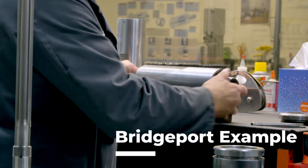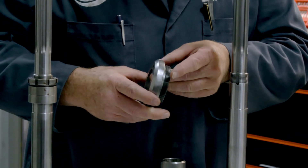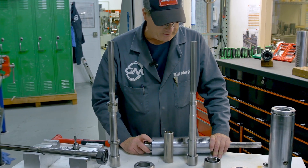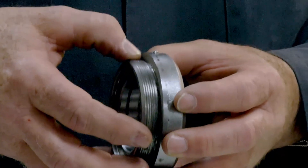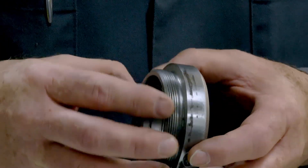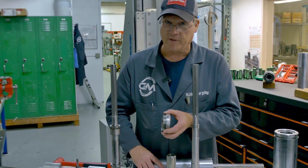This is a typical Bridgeport that's come in. It's been shipped in pieces, got its nose cap on there and has been highly modified. This little set screw hole on the top — you want to make sure you get that out before you turn anything, or you end up having to beat it off and you can't get it out. It's got multiple grabs and scores where the set screw has rubbed. You have to get that out of there. When you take it out and see threads, go ahead and drill it, or you leave little marks with mashed-over threads and that's what tears up the housing — it doesn't hurt the quill housing as much as it does the nut.